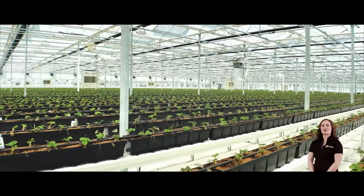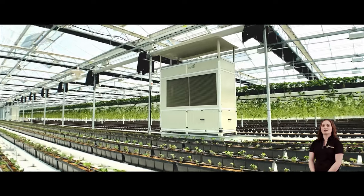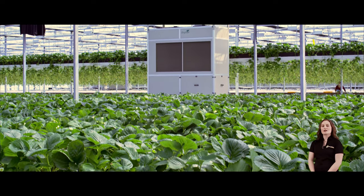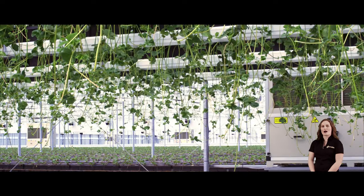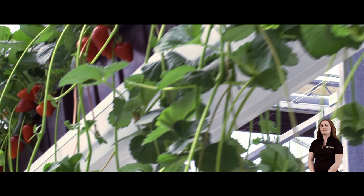Lastly, we have the Dry Gear DG12. This customer utilizes 72 DG12 units for growing their strawberries. These dehumidifiers remove moisture from the air and eliminate the need for nighttime venting. The DG12 covers up to 40,000 square feet and condenses 12 gallons or 96 pints of water per hour. It has an airflow rate of 12,950 CFM.